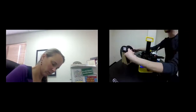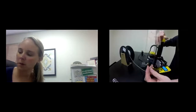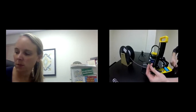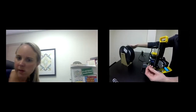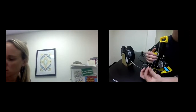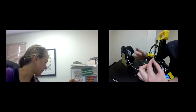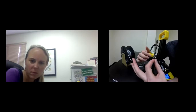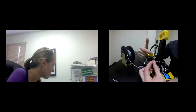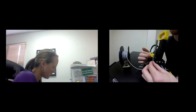Once we have that ready and the printer is seated and heated, we go to the back and look at the E motor — there's a yellow trigger and spring on it. We need to squeeze that trigger and feed the filament through the hole right next to the big spiral. You should be able to turn it to the right and see the hole next to the big spiral. Squeeze the trigger to release the pressure and push the filament through.